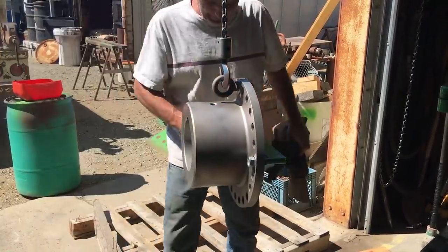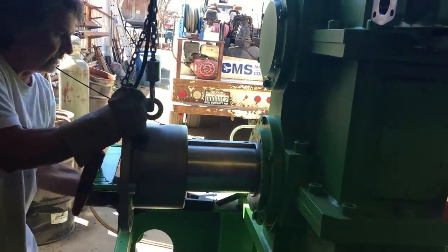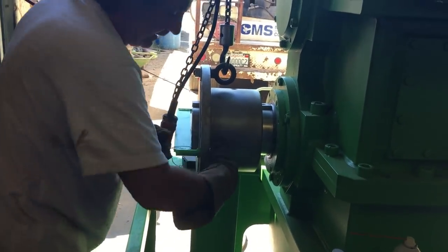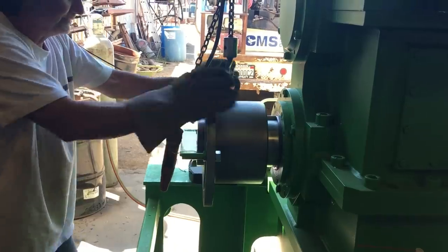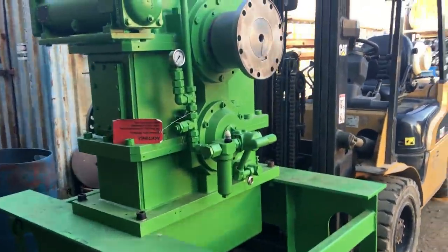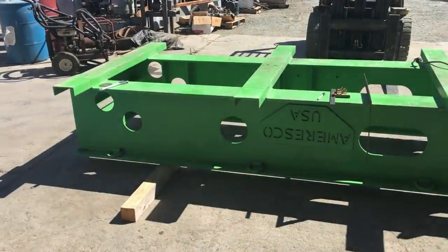Here I just bolted up the stop plate so when I slide the hub on I just go all the way up against the stop. You'll see a little piece of wire — the only difference in these particular gearboxes is I put a shim right on the plate with a piece of wire so I don't have to readjust the jam nuts on the tool cell. Then I slide it on and wait for it to cool off. This gearbox is ready to go out; it'll set right on the front part of the deck of the trailer and be delivered with the reman engine.